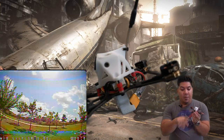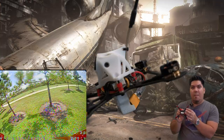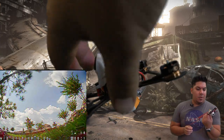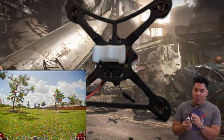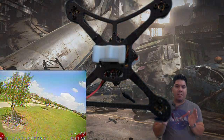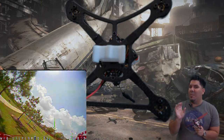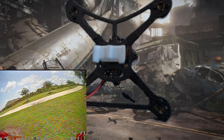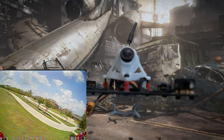Now the Bard Lil Floaters motors. What do you notice about these things? They only have two motor holes. Is that gonna be enough for such a high revolution per second motor like this? I was a little worried about that at first, guys, but I think we're gonna be just fine. If you're worried about it, put a little dab of blue Loctite. I'll leave a link in the description for some. Every quad builder should have that on hand at all times, and you won't have any issues.